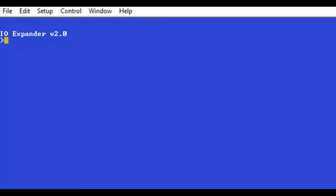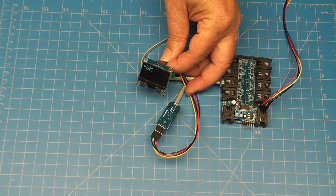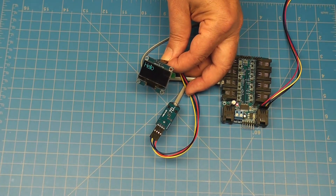If you do not know the address of the 1-wire I2C adapter, use the command I2C on pin 4 find, which will return the ROM ID. Use the command I2C select 4A, sensor type 13, sensor initialized, sensor clear, sensor display 00 string hello, sensor display — which will return the selected 1-wire I2C adapter sensor type, I2C address, the initialized screen resolution 128 by 64, and OK to update the OLED display. The 1.3-inch OLED screen will display hello. The fonts that draw the text are all generated by the IO Expander.